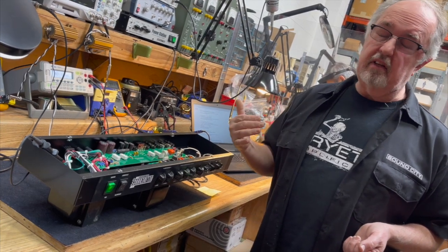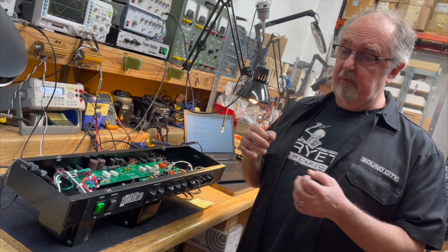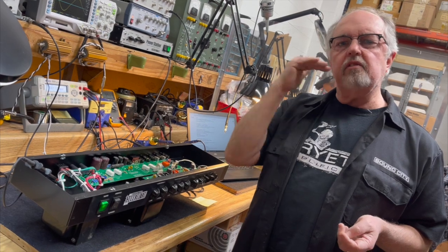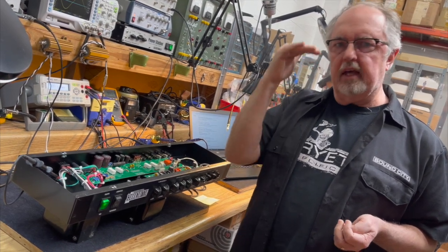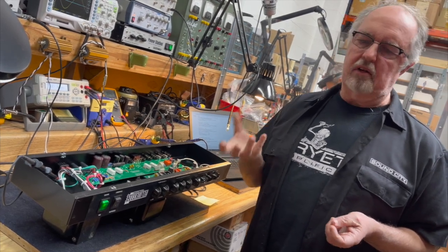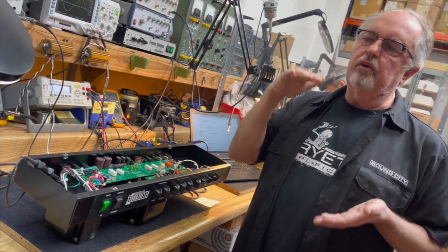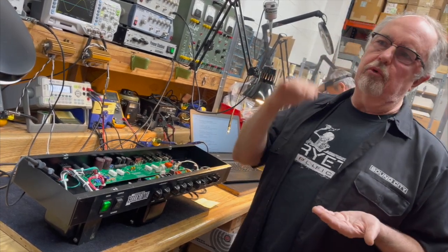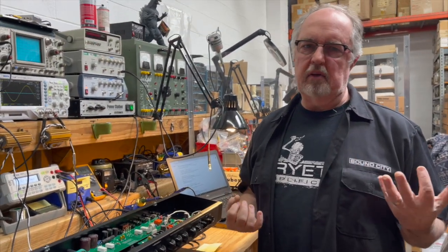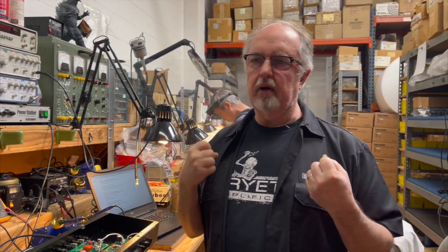And there's advantages and disadvantages to that. One of the big disadvantages is that because it's on a regulator, even though you set it lower, it's still on a regulator, so it stays fixed where you set it. So it won't sag, it won't respond dynamically to your playing. And even though it's a cool idea, you just get more power tube distortion, or power tube induced distortion, by dint of the voltage being lower, but you don't get a dynamic feel. You don't get a touch sensitive kickback response from the amplifier with a circuit like that.